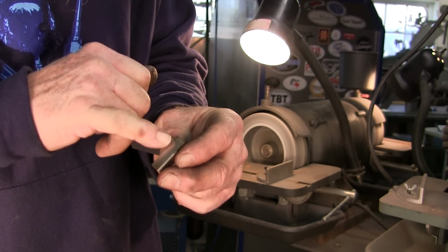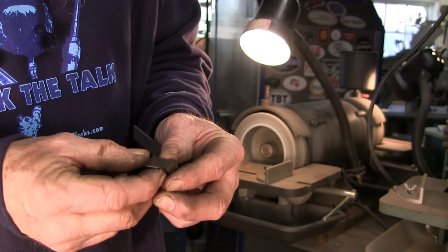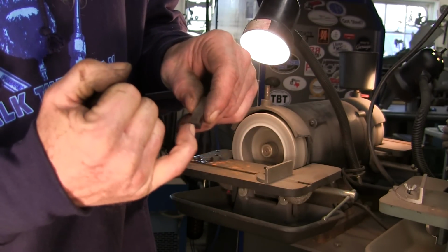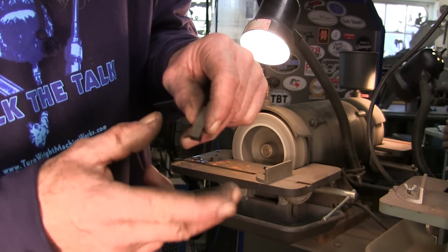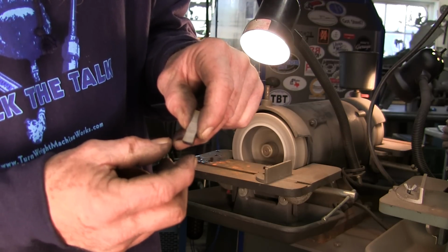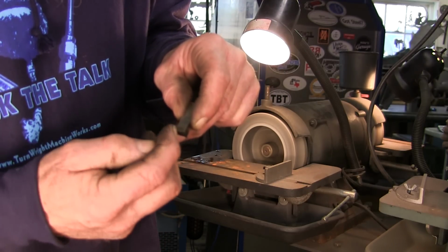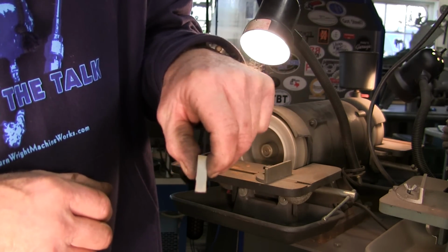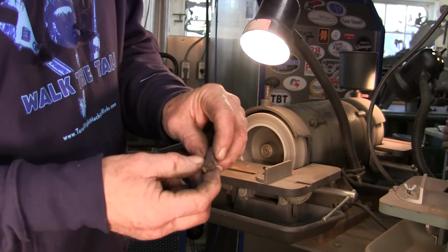Whether we do something on the very face of this is not necessarily needed, and sometimes I might actually put in a center groove in here, because we're going to be walking this thing back and forth. This is 3/8 of an inch mean diameter, meaning it's slightly under. I've ground the sides just slightly, but we're going to be coming out to a 3/4 inch, so we're going to be moving this at least 3/16 of an inch side to side across the bottom to get that width there. So we could put a groove in the middle here with relief so that we could come down and then work side to side, come down, work side to side, come down, work side to side. We don't know yet. We'll take a look and see what we need.